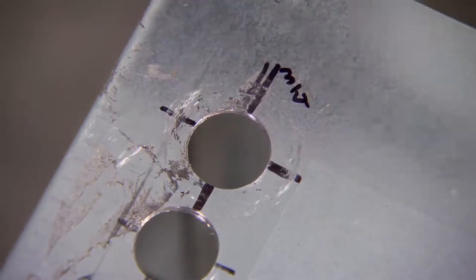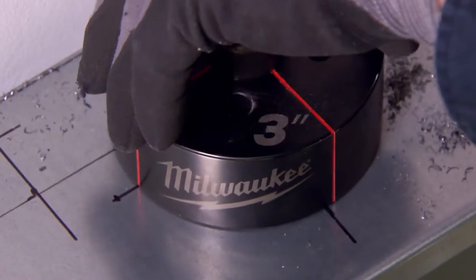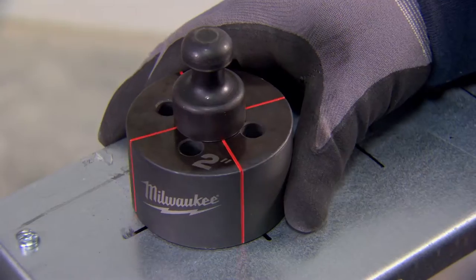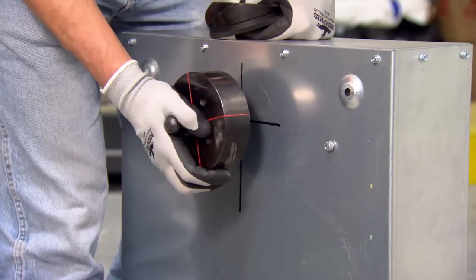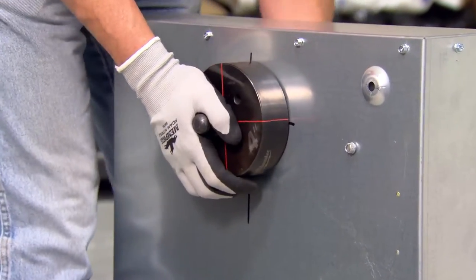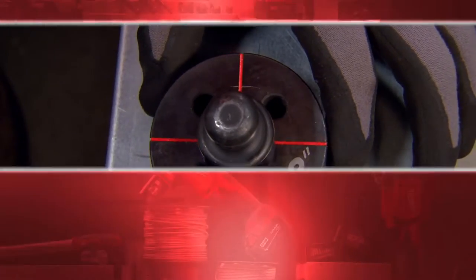Accuracy is very important. You may be running a whole rack of pipes — there's no room for error. We're running conduits out the top of a panel; they've got to be exactly right on the mark. With the crosshairs, that allows us to be exact and get our hole exactly where we want it. That way it eliminates offsets. I'm not spending time measuring to make sure that die is in the right spot because I can see it easily enough that I'm already lining up the crosshairs on my marks.